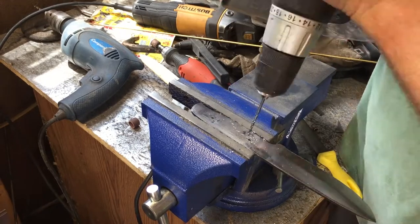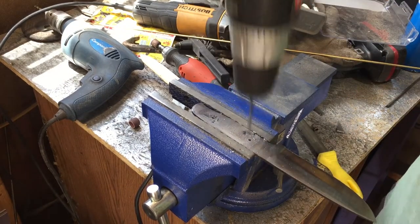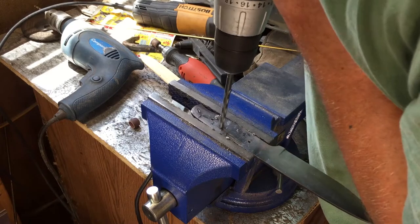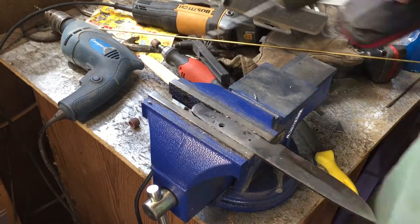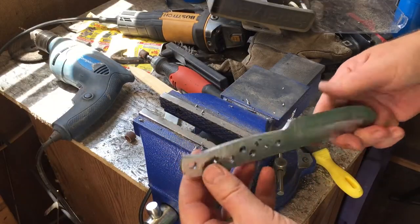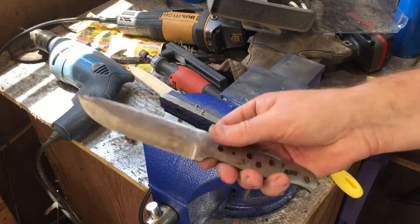Basically what we're focusing on today is finishing up the knife. To do that, I'm drilling holes for the pins that will hold the scales on, and I'm also drilling a few extra holes to kind of lighten up that tang. My bevel comes about halfway up the blade and it's a little bit uneven, so by the end of this we will have fixed that.